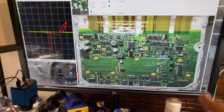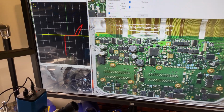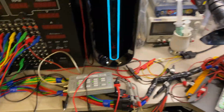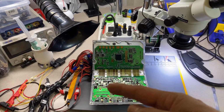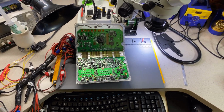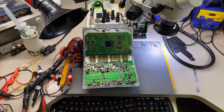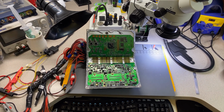All right, so with this software I explained before, this is a curve tracer, but it's nice because you can create your own database, and it has dual channels. This is the tool right here, and it has dual ports in here. So with that, I can test components from a known good to whatever bad computer. Sometimes you have many computers to repair, and then you can do that. Or you have a component that you can test outside and then remove it and test it, if you know which one is the ground or so.